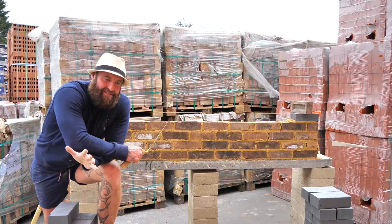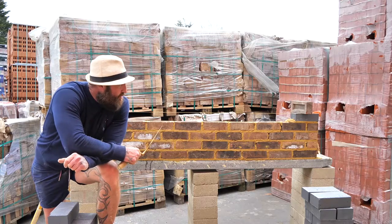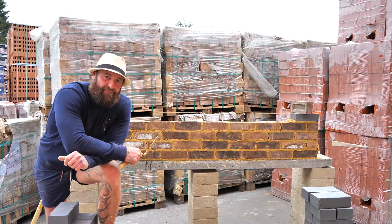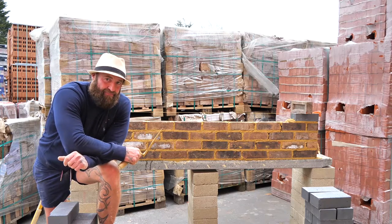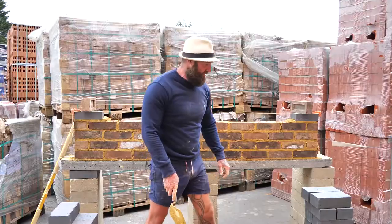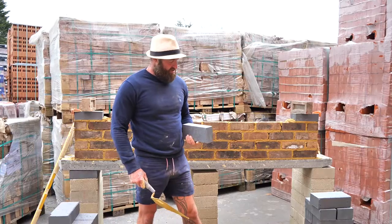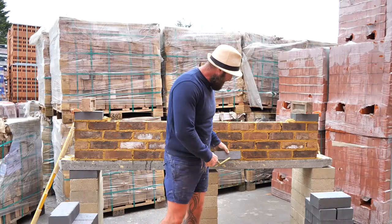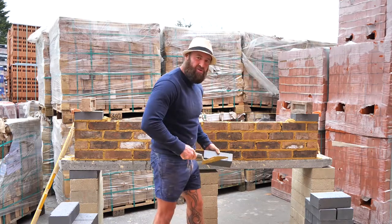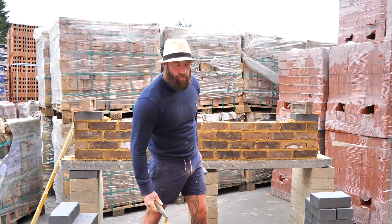What I want to do now is teach you something about knowledge, the paperwork side. So, 2 fundamental parts of building a garden wall are damp and the weather, rain. From the foundation, we need to stop that water rising up the wall. So it's common to use a blue semi-engineering brick. These are made from different materials, ceramic, so when it goes in, the brick doesn't absorb the water, it smears it off. So any water rising, it will stop. In other words, like a damp course. But we don't put a damp course in garden walls because it makes a weak point.